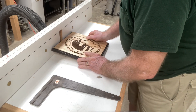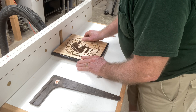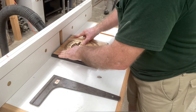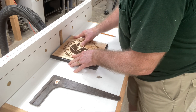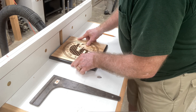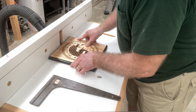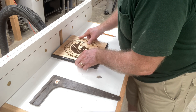Just like doing it on the CNC machine, this goes very quick. With the router running, I take the plaque above the router bit and push it straight down with the edge of that plaque right on my line. When I have it all the way down, I move it to the left and work my way over to that second line — that is the end point. Once that's done, I move back to the right and exit out. This whole process literally takes just a few seconds.